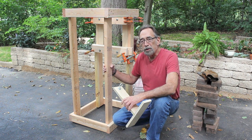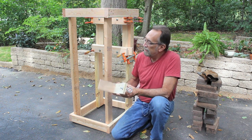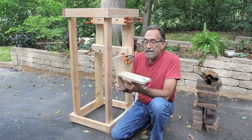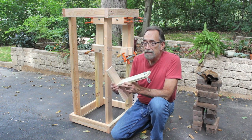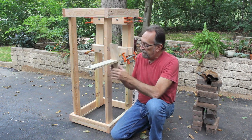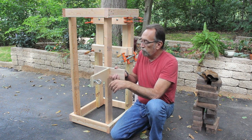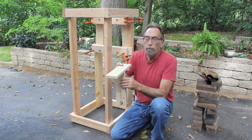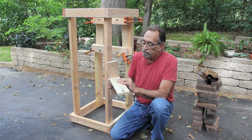We're out in front of the Down-to-Earth Woodworking shop today — outside — because we're going to do the dado torture test to see what is the strongest depth for a dado in three-quarter-inch plywood. Got nine samples made up. The dados have been cut one-quarter-inch deep, three-eighths-inch deep, and a half-inch deep. There are three different tests: the shear test, which would be like pulling down on a shelf in a bookcase; the tear test, trying to tear the piece out of its dado; and a simple pull test, pulling on the plywood to see how much weight it takes to break the bond.